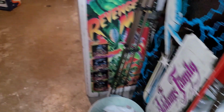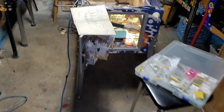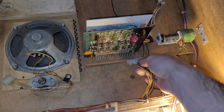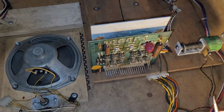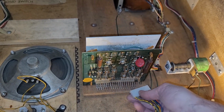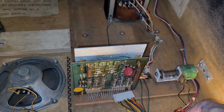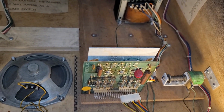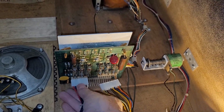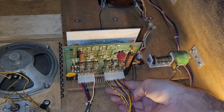Okay, so I have repinned the two J1 and J2 connectors on the rectifier board, and you can see that that's going to go here. This one honestly didn't really need to be repinned, but since I was doing its brother, I figured I'd do them both. So they will go like so. Ow. Stabbed myself on J3, you little bugger.